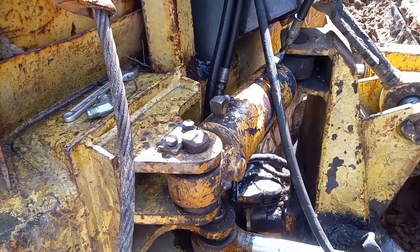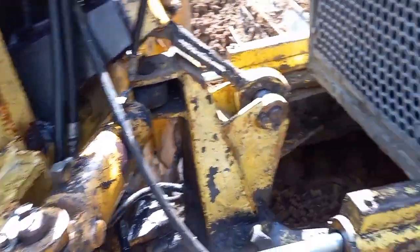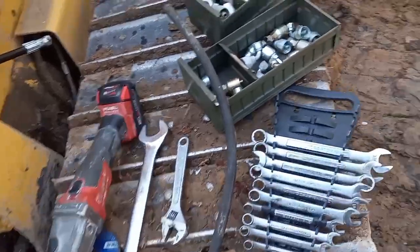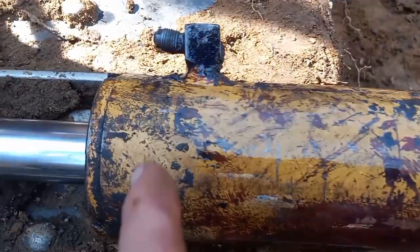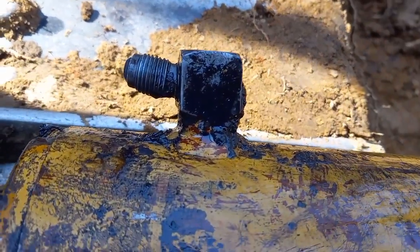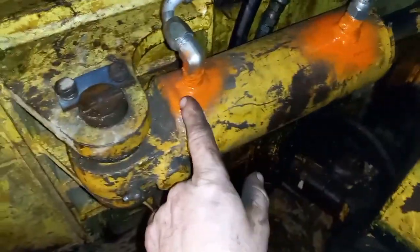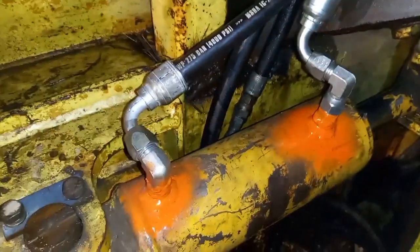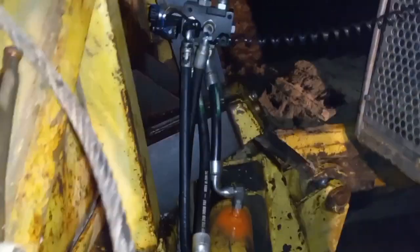What are you going to do? Could be worse. Beautiful day. Got that fire going good. The Lord is with me, so no complaints here. You can see a little better that that had broken down on the bottom. I had to cut the ports off and weld on some fittings. I've offset them and canted them upwards and done everything I can to tuck them up tight here against the blade, because before they used to loop out up here and actually touch the radiator a little bit.